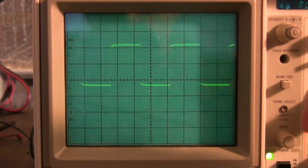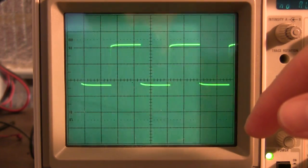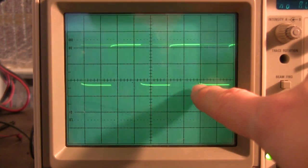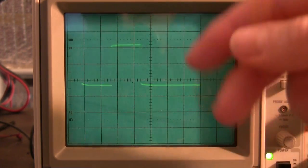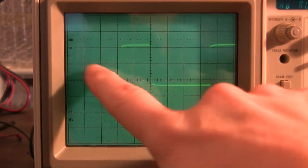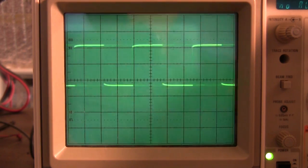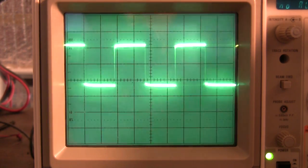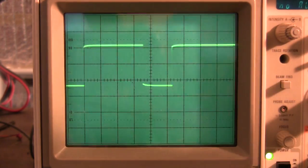Right now I'm just holding down the button, and it sends out a string of commands every time, but if you lift up on the button and press again, it toggles that bit from high to low, high to low, every other time. So the device knows to behave differently on another discrete button press rather than just holding the button down. So all we've got to do is pay attention to that toggle bit. We've got to look for these 2 start bits, 1, 1. Pay attention to what state the toggle bit's in if we want to act accordingly, and then look at these last 6 bits. We can ignore the address for now, the 5 address bits in the middle, because we aren't going to set up multiple devices yet, but we just get the binary number out of these last six bits and make the pins on our micro do something with that.